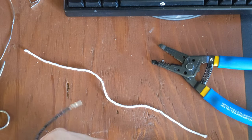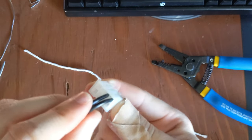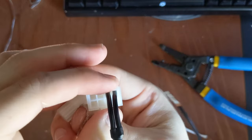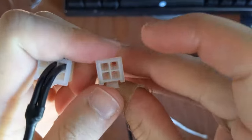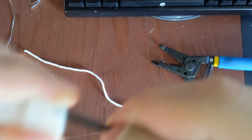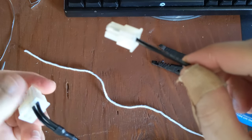Now I need to insert it into the other side of the connector. I'll have two links in the description to guidance photos on what pins go to where. Since this is a CPU 8-to-4-pin, it's pretty self-explanatory. This Y splitter cable is going into the top right, so I'm going to insert the other end into the top right. Just like that — clicked in. Give it another tug to make sure it won't come out. That is one out of the four cables for this cable crimped and terminated.